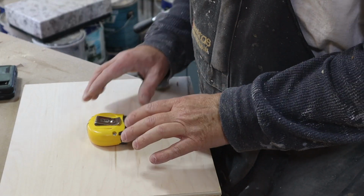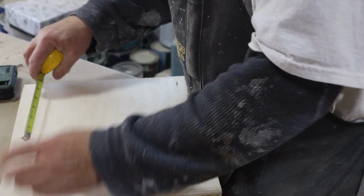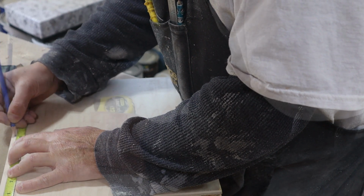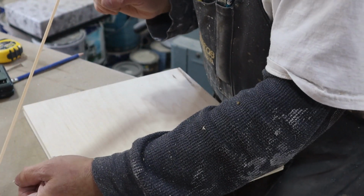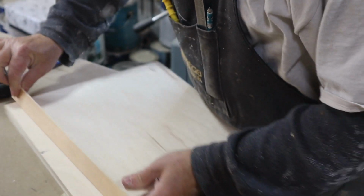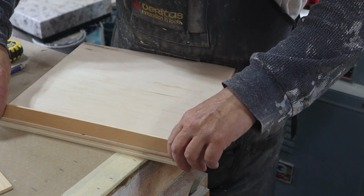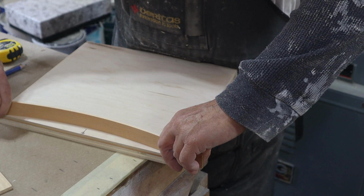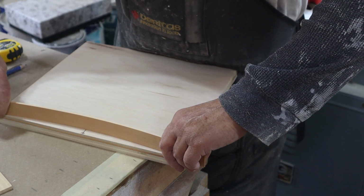Because this has no handles, I want to keep the same concept with the no handles. So this is measuring at 12 1/8. I'm going to measure 6 1/16. That's going to be to center. I'm going to do a cutout. So I got a 1/8 of an inch shim that I cut. And I'm just going to bend this, keeping it at corner to corner. And then I'm just going to bend this in. And I'm going to mark that. And that's going to be my handle to pull. And I'll just cut that excess off, edge band everything. She's ready to rock and roll.